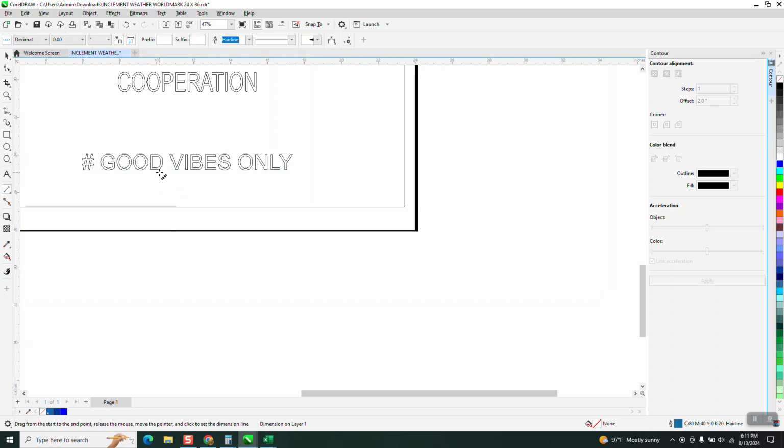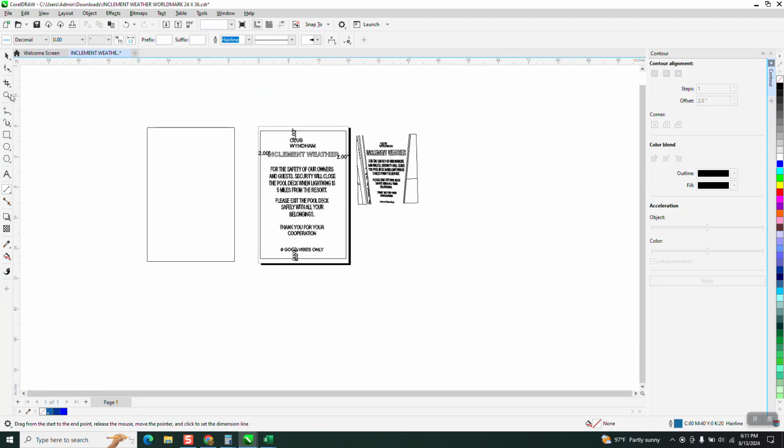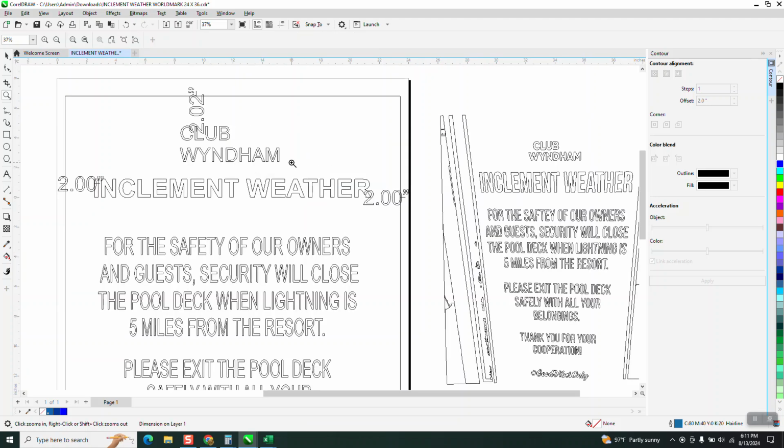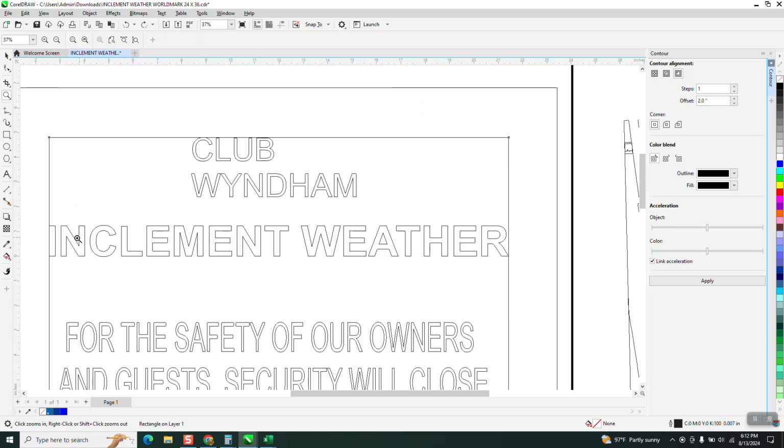Now here we have something to snap to. We got a line, and we're at 2.01, 2.02. Well, that's equal, but it probably really is. Because if we back up here, let's back up to where we had the contour. That line is touching everything. And now let's measure it per that line. Let's zoom in a little bit. Get your parallel dimension tool.